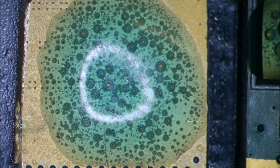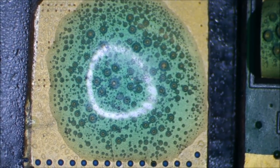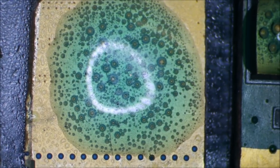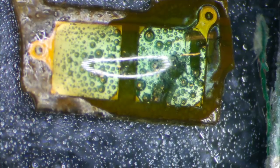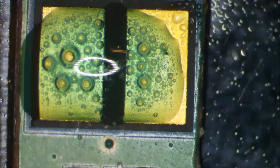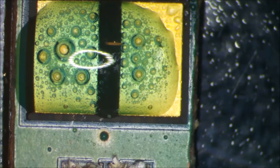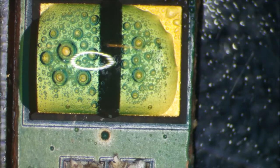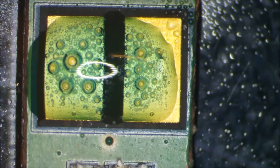Pretty much the same thing for the Samsung general-purpose touchscreen phone. This reaction took a while to get started on the big pad, which suggests the coating is actually a little bit thicker than the other ones, but we'll see what it looks like when we give it a scrape. This reaction here happened very fast - I can already see little bits of gold around the place as the base metal is getting eaten underneath. The non-keypad side of the SageM phone shows a pretty standard ENIG-type reaction, possibly a little bit thicker than my test ENIG coating.